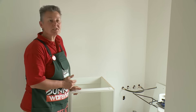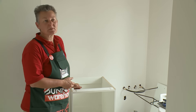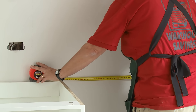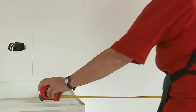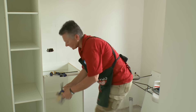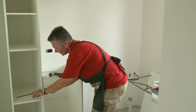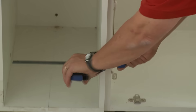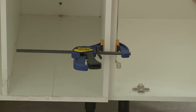The first step we need to do now is to put the cabinet roughly in place and take a few measurements. I'm going to measure and just make sure that I've got enough room to fit my bench in and that everything lines up. I'm going to clamp this cabinet to my existing one. That will make everything nice and secure, and then I can fix into those two cabinets, holding them together and also fix down the back wall into the stud work.